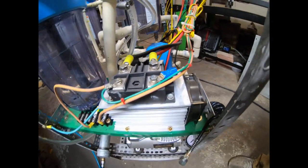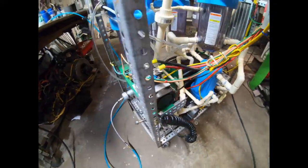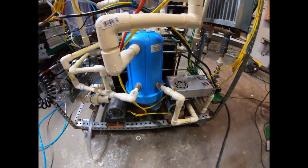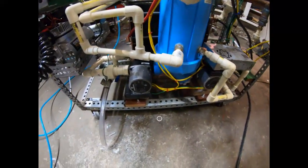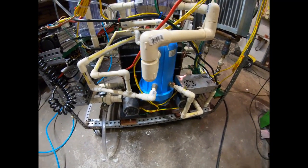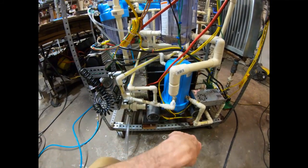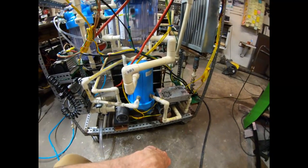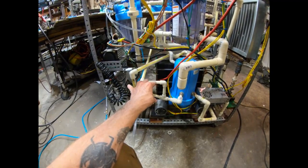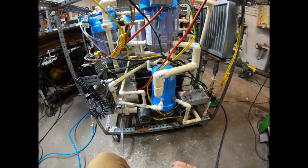Quick little walk around — here is our massive diode. It's got a nice little heat sink and a cooling fan. This here is our main reservoir, connected to two flow pumps. Those flow pumps mitigate something called polarization, wherein bubbles accumulate on the plates so badly that it diminishes the active surface area available for the electrolysis process.